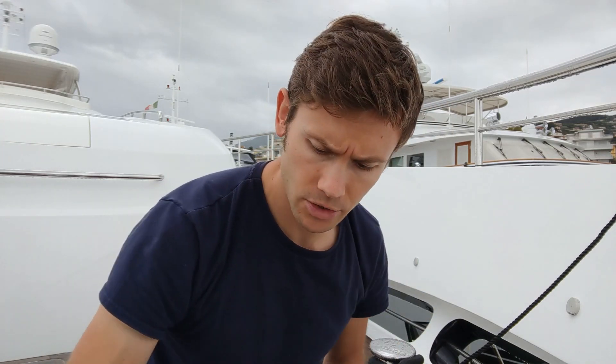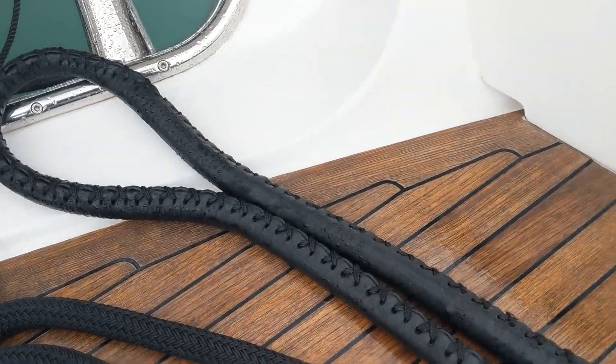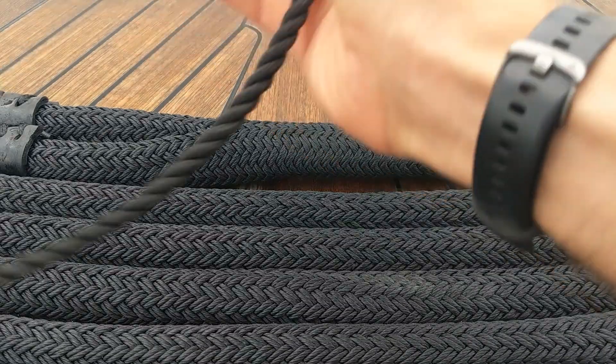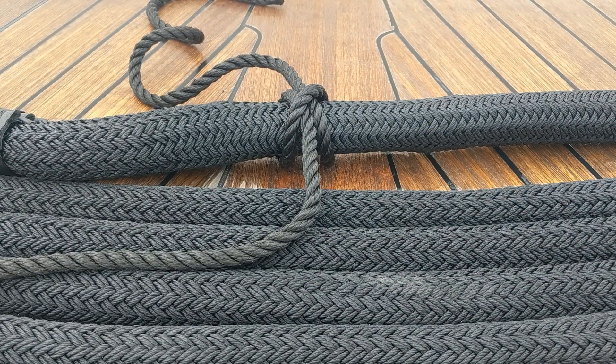Connecting the heaving line to the mooring line: if you connect your heaving line at the end of the eye, there is a good chance that when it arrives ashore the line handler won't remove the heaving line first. They'll put it on the bollard and your heaving line will become trapped between the mooring line eye and the bollard. You'll not be able to get it off until you release tension on the line when you want to leave — needless to say, this will get you a beer fine. That being the case, you'll want to tie your heaving line to the mooring line about here. My knot of choice for this is a simple clove hitch, and just to be sure I sometimes like to add one extra half hitch.